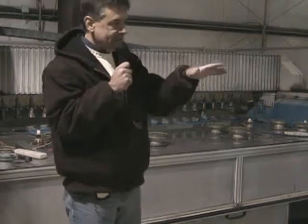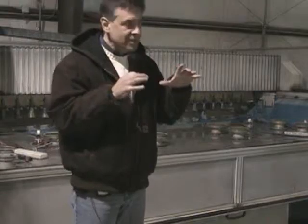What's really cool about this is that each one of these suction cups is also a blowing device. And so when they take the granite and set it on top of the suction devices, then it's kind of like playing air hockey. They can maneuver the granite around very easily to set it in the right position. It's really cool.